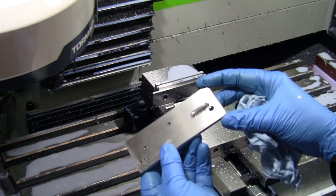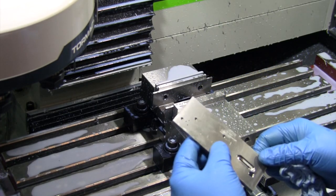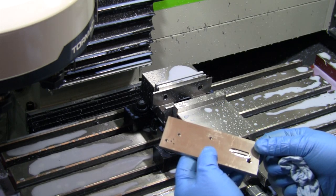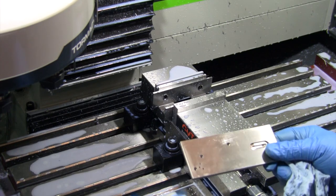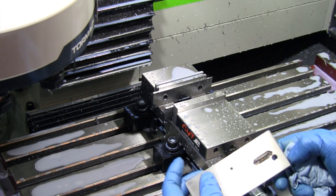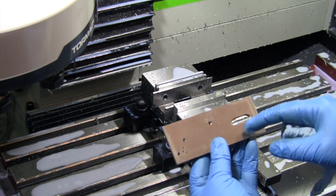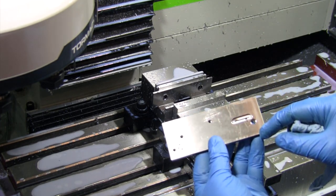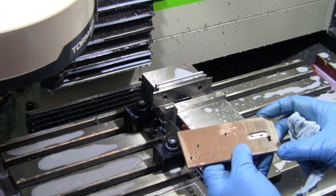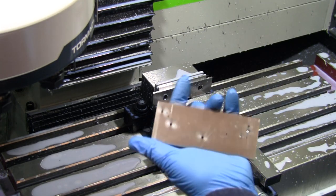Overall that was a successful cycle. The counter-bores look nicely centered and lined up. I'm going to double-check the depth on that groove, but other than that 3/16 hole being too big from before, the rest looks good and functional. I ended up running at about 50% feed — four inches per minute on the bigger slot and three and a half on the small slot — that's where it sounded good and cut nicely. I'll go tweak that in the program and resend the code so it runs at 100%.